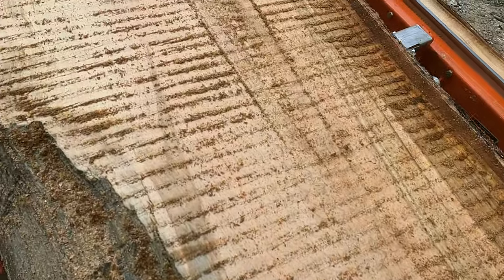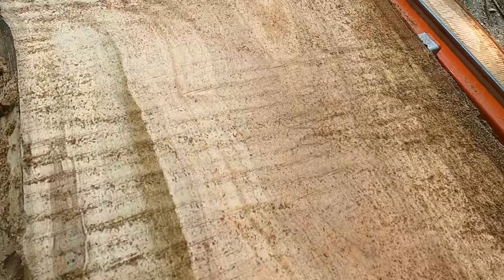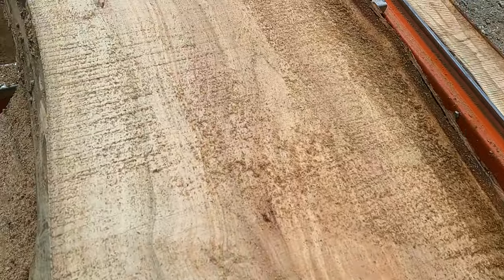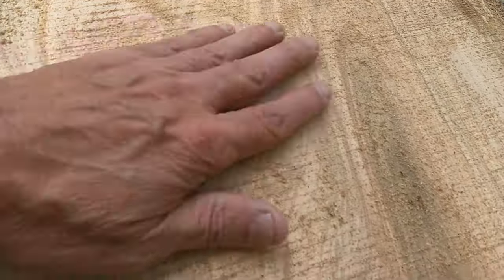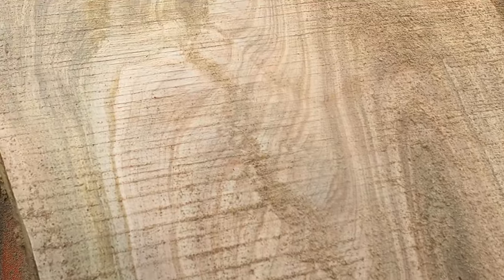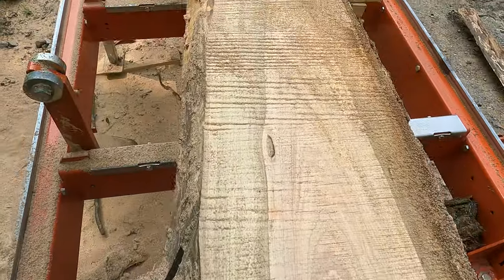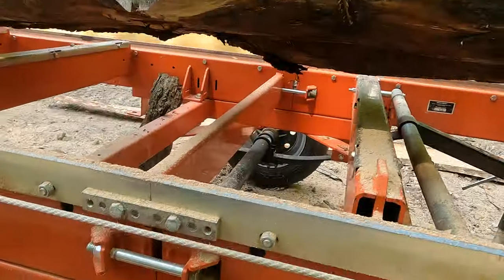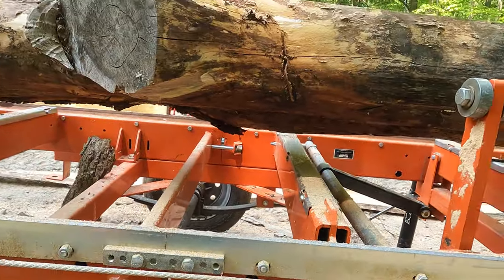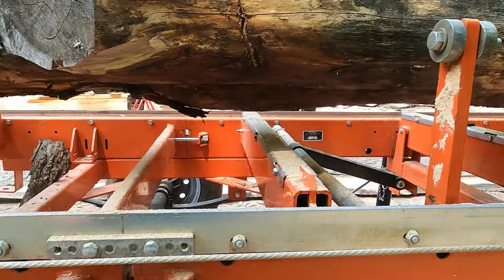Suppose you want to see the wood. A lot of washboard in it at this end, because it's really dry and hard, so I kind of have to go slower than I really should. But when you get up here, this is kind of pretty. And you can see there's green and red and it goes all the way down to the end. And this is the problem I'm having. You see how that's up? There's the top, there's the bottom. There's only 4 inches of solid wood in there.